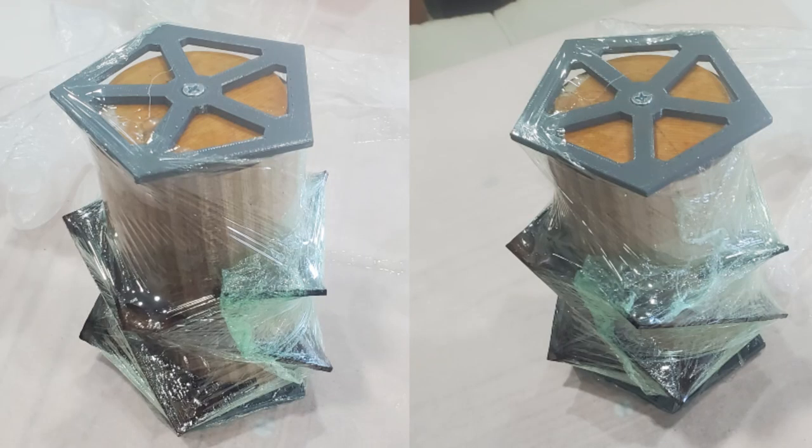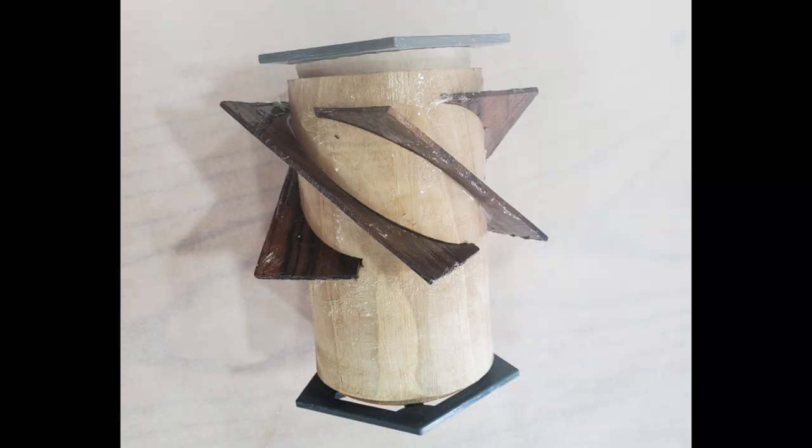Then off to a cool place to epoxy the dark walnut slices into the project wood. Even with 30-minute epoxy, I recruited help to mix and spread the epoxy and insert the slices. Shrink wrap will help keep everything together until the epoxy hardens overnight. With the epoxy cured, I remove the shrink wrap and then the templates at the end of the cylinder. I am ready to start turning since I already have tenons on each end.